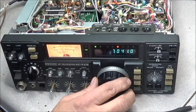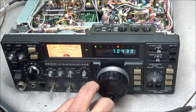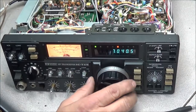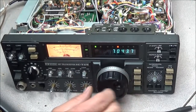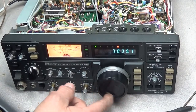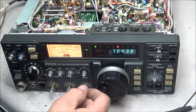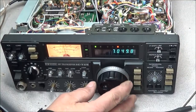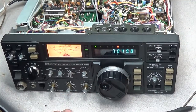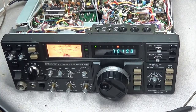The VFO is acting like it's supposed to now. I just stuck it back on there without putting all the knobs on yet — just enough to get it going. That VFO was really causing some havoc, but she's good to go. She spins around very nicely now. I did put a little Loctite on that nut so it wouldn't come loose again. Now I'll get the front end finished up, then we'll get into the VCO and pull those cans off to have a look at the trimmers.